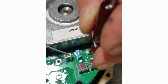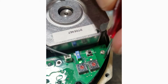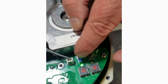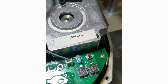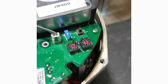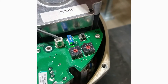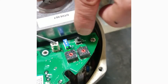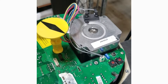If I move the switch, the LED does not come on when I push the button, so we're not set up for these two particular parameter and variable settings. If I put the unit into program and push the button down, now it's set, and it will confirm that four and four is indeed the setting. Here I have the open speed set for the fastest possible speed. I can change the speed by moving switches 4 and 6 to the proper positions — this will give us the slowest possible speed.